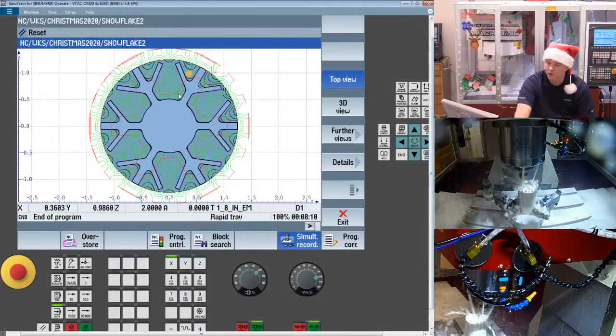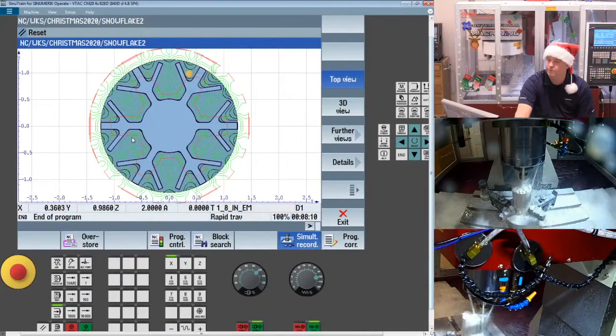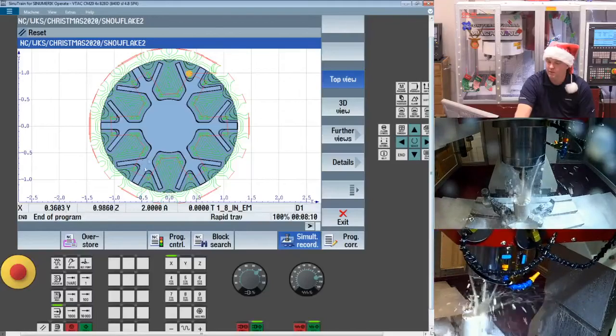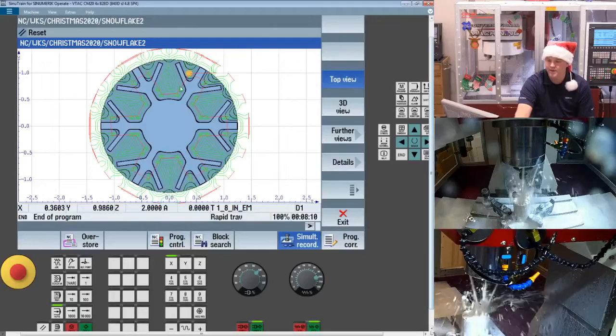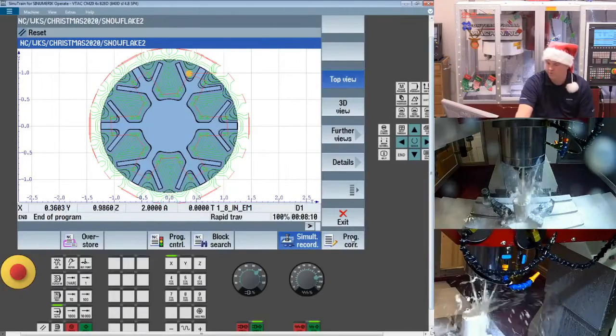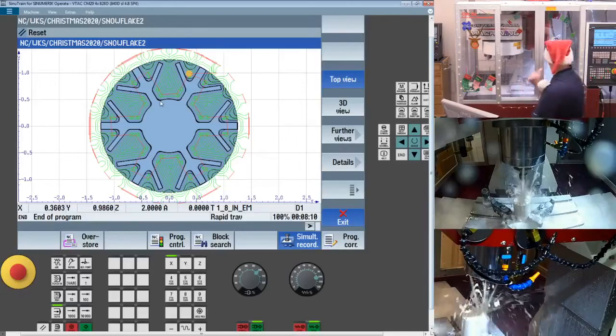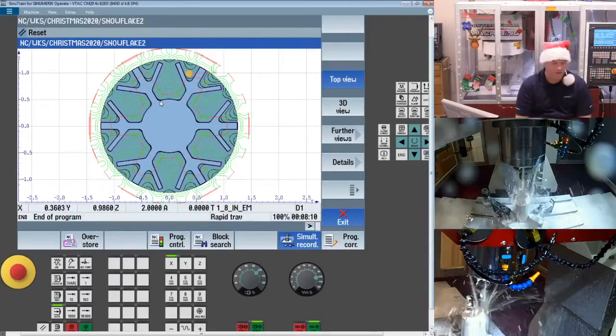Now you see these little loops on the part? That's where the residual material detected a significant amount of material left from the previous tool. And it's even bigger when you get into these radiuses. And then we came in, we cleared, and then we did a final profile pass all the way around the part. So that gets us basically to the point which the machine is at, right?